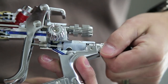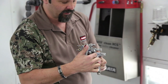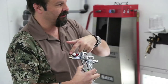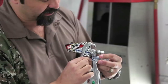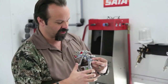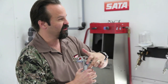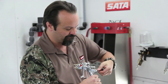On this cutaway version, you can see what that air micrometer does. That little air micrometer opens and closes a valve. When I open it, air comes into the handle and blows up through the hole in the bottom of the air micrometer, then goes through the spray gun. When I pull the trigger, it opens up the packing to slide back and opens the air passage to the front of the gun. On our digital gauges we also have a secondary air passage that allows air pressure to go back down into the digital gauge.